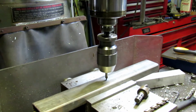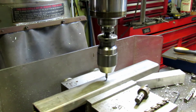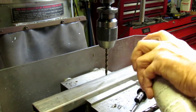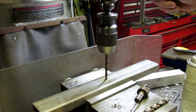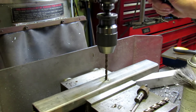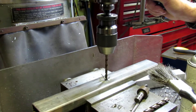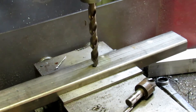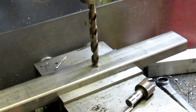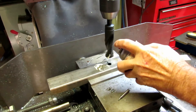I started by cutting some stainless steel tubing — I had a little piece laying around. It was stainless tubing so I figured it would be kind of food safe. I cut two pieces to length; it was one by two by eighth inch wall seamless tubing. Then I had to drill a hole in the top member, and I decided to make a very simple press using some stainless steel threaded rod.